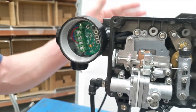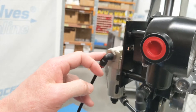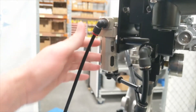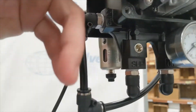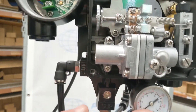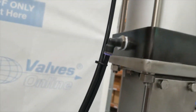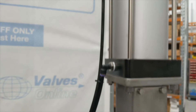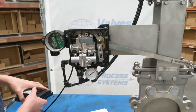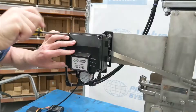Around the back, we've set it up with a filter regulator. This is our input supply coming in here, going around into the supply port. Inside the positioner is where it balances. The output is where the pressure gauge is, and from here we're running our signals up into the pneumatic cylinder which drives the knife gate valve.